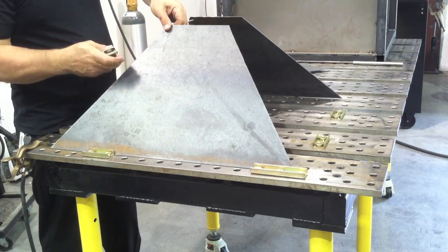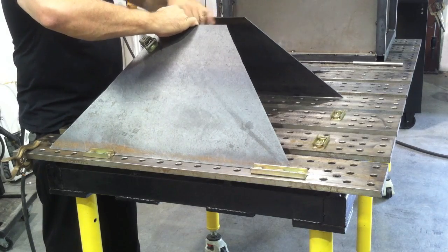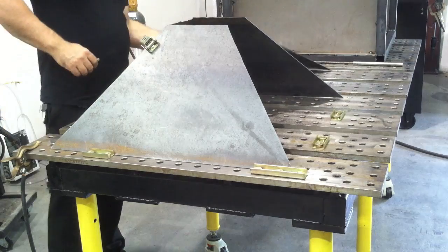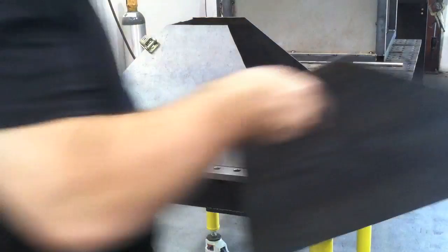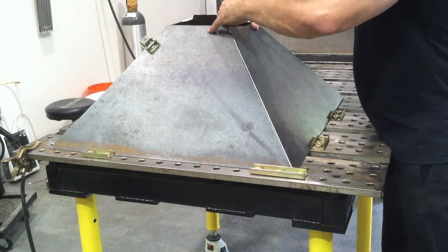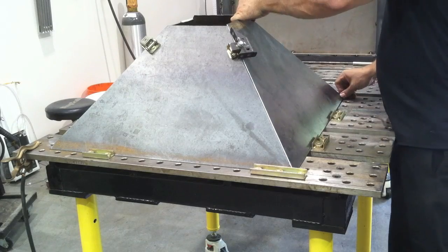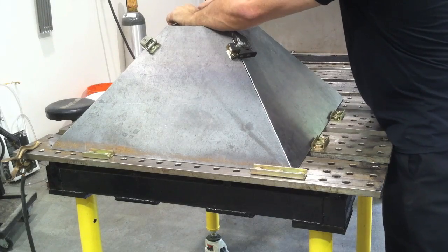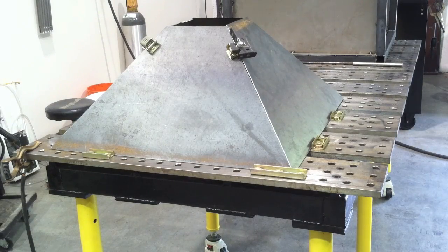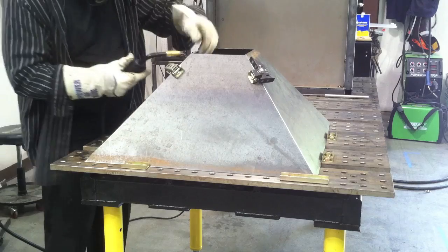Sometimes you make your own luck. I've popped that little magnet on there and it gives me like a third hand. It looks like it's going to go together pretty well. It would have been more accurate with a shear — could have gotten within a thirty-second on the cuts — but the plasma cutter, along with being able to fill a little gap with the MIG welder, and the fact that this thing is just a funnel that's going to have all kinds of dross and spatter stuck to it in a week, means I'm not overly concerned with being perfectly accurate. I just want it to look good and fit and be able to weld it in.